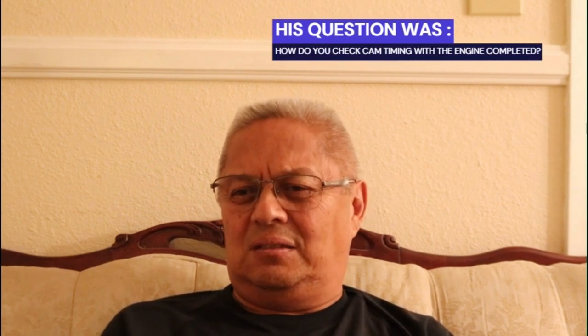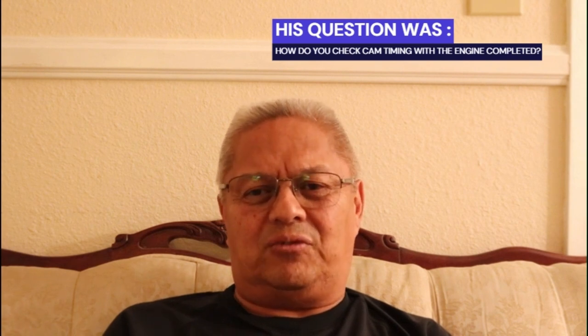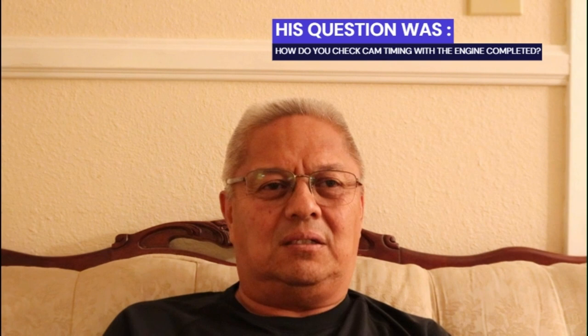As a side note, I dealt with one magazine guy a long time ago when I had my shop by Glendale. I was doing an engine, and I had it open. It's a small block Chevy, and he says, how do you check if your cam is on time, with the heads on and the timing covers on? I said, well, it's easy, come right here. So I went to number one, got one of those 6-inch straight edges, and put a flashlight behind the two lifters. When the two lifters at overlap went up to zero and I couldn't see any light, I said, look at the dampener. If it's TDC exact, this camshaft is timed.